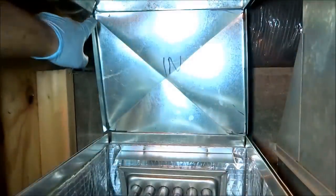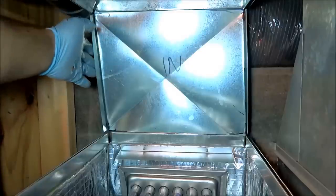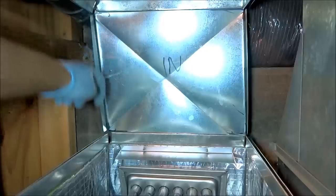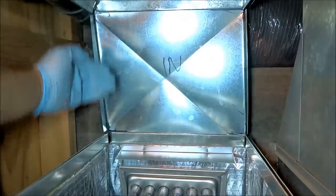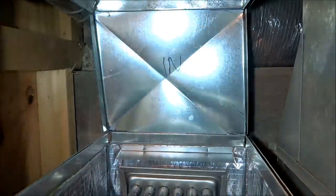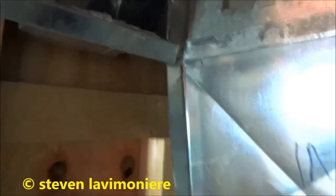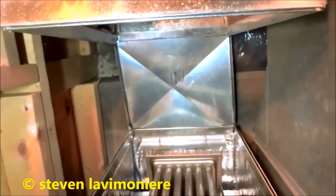Next I'll get a couple of S-locks on each corner. Then there'll be my other piece that slides into that and comes out. My next piece I'll slide in there, cut this angle so it fits in the S-lock. It's not coming down perfectly square — it's off an inch or so. Sheet metal is not hard to do if you do it this way.